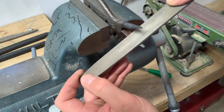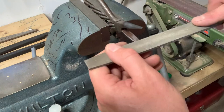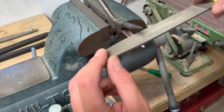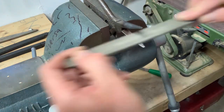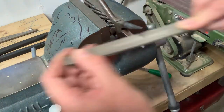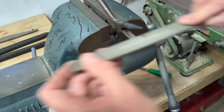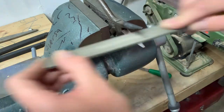Be careful not to put too much pressure on one side or too much pressure downward. Try to keep your pressure even, or you'll wear away too much in spots. Watch where it's removing the most metal. Long, even strokes with the file seem to be the most effective. Look at how easily that metal is removed — it's coming right off.